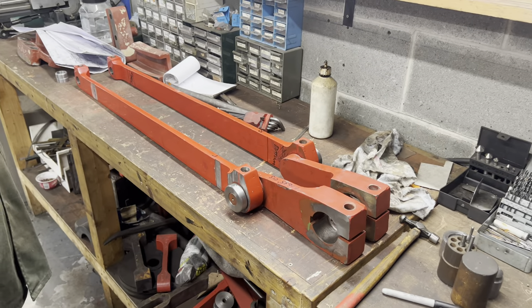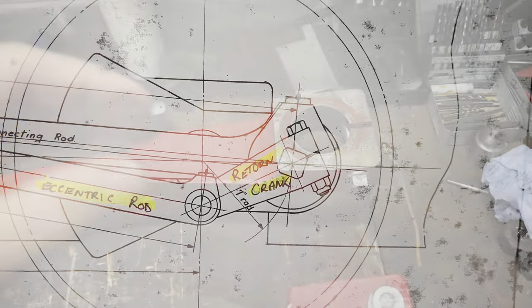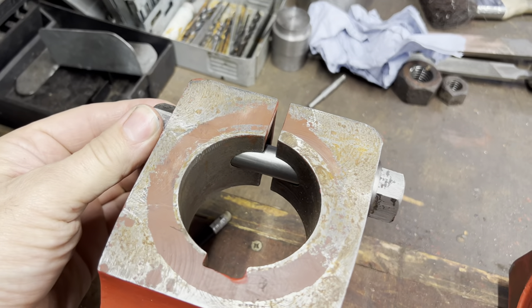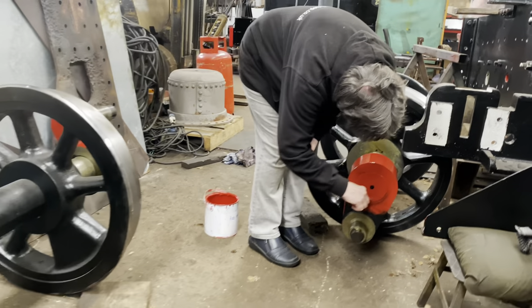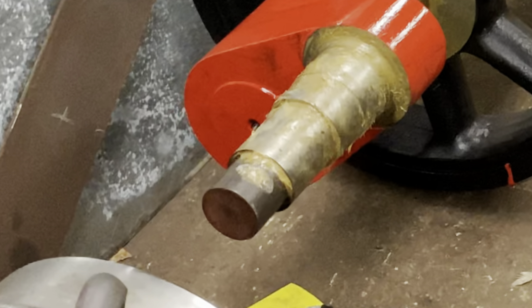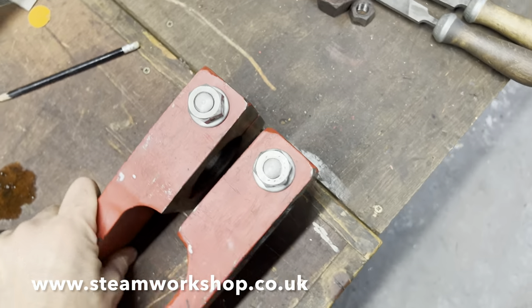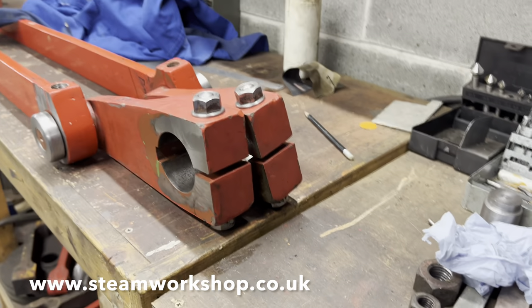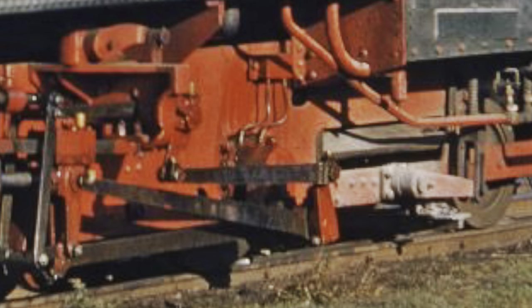That's the whole assembly rigged up on the bench. Lastly, the holes in the return cranks have a pin that goes straight through the side of the crank pin itself — the locking pin that allows it to tighten up intrudes onto the actual round crank pin. This is the crank pins being painted by Jenny — you can see when you look closely at the end there's a little scalloped-out part. That scalloped end fits the pin, and it helps to locate it in exactly the right position. There's a keyway as well, but that helps do the same thing. So there we go — new bolts, new pins, and all of that assembly is now finished and ready to go back on the engine. Thanks ever so much for watching — there'll be another video along shortly.